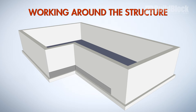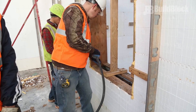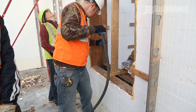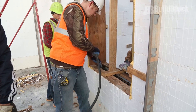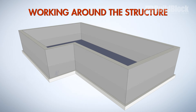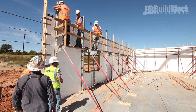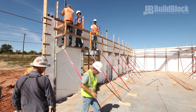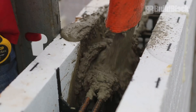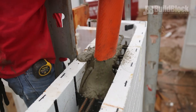Working around the structure, ICF lifts are poured to a height of four feet. The initial four-foot lift should reach the bottom sill of windows so that consolidation can be accomplished during the first lift. Once you reach where you first poured, continue pouring, repeating the process four feet at a time. This process is repeated until the full height of an ICF wall is reached. Typically, a total wall height of no more than 16 feet is poured at any one time — this is the recommendation of most bracing manufacturers as well. The time difference between pouring in multiple lifts or all at once is negligible since concrete is pumped at a constant rate.